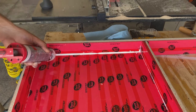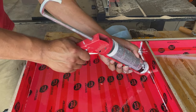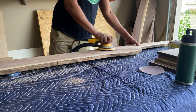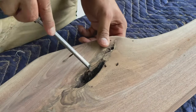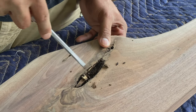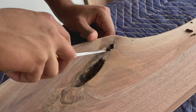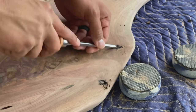Some of the best advice I can give with my limited epoxy pouring experience: give your silicone a full 12 hours to cure. Some bottles say they're ready in four or two hours — don't risk it. Epoxy is really expensive. Give yourself the 12 hours and then make your pour. Before we can do that, I needed to chisel out all the punky or dried-out dead wood from the slab. This is common with any hardwood slab — you'll have spots that just need chiseling out and cleaning. We'll backfill these with epoxy, so it'll give a really cool look.